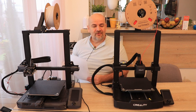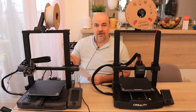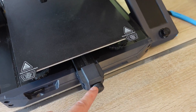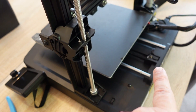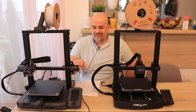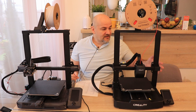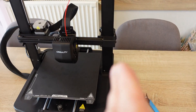With Creality I'm not always sure whether changes are genuine improvements or just cost-cutting. For the belt tensioner, the S1 has knobs on the X and Y axis while the V3 has only screws. For me this is not really a disadvantage because we have to adjust this very rarely — maybe once a year or even less. And the screws don't stick out, so less space is needed.